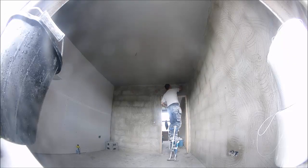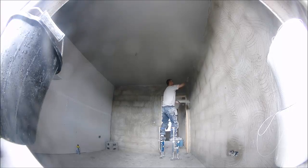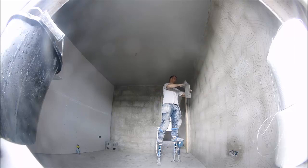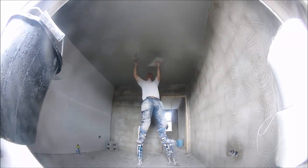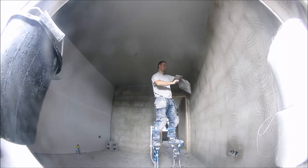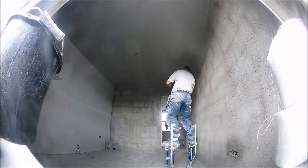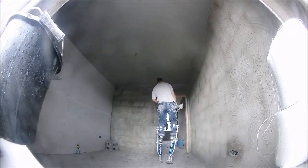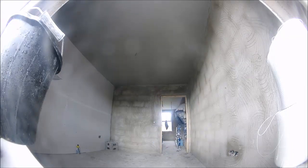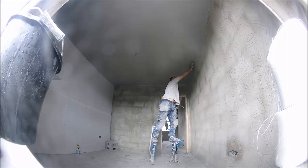When you are applying this, you'll be sort of ironing it in as you go — keep the trowel fairly flat, lifting it off maybe half an inch to an inch, and keep it as flat as you can with your coating. It's very important that the neater you coat, the neater your troweling will be, and the easier and quicker you'll be able to trowel it in, get all the blemishes out, all the lines and marks, and fill all the holes.